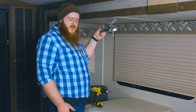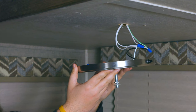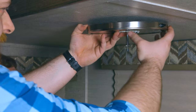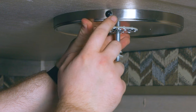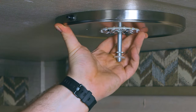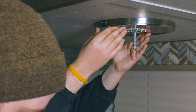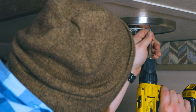Next step is to go in here with the screws and mount this into the ceiling. Now that we've got our wire nuts on and our wires are all joined, we're going to tuck our wiring behind and underneath this. We're going to press this up against the ceiling and position it right about where the old one was. We'll make sure to pay attention to where the switch is, because that's going to be important — you want to make sure you can reach it. Going in now with about inch and a half long screws through the holes and we're going to screw it into the ceiling.